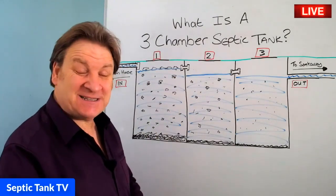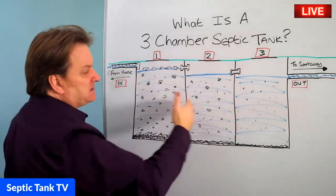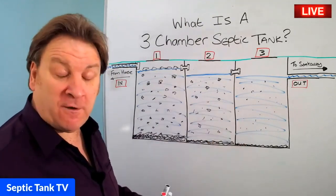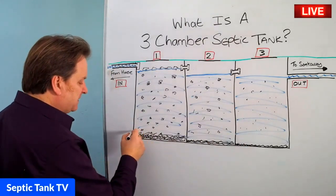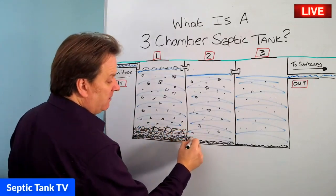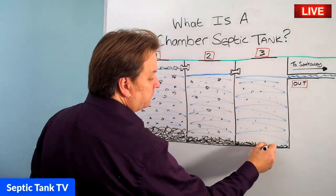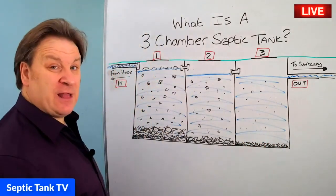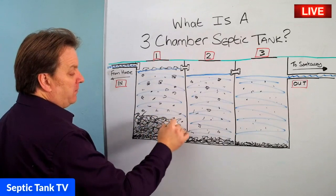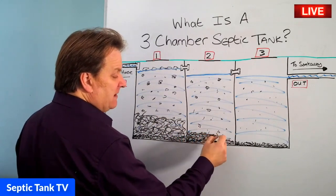The only reason you get your septic tank desludged or emptied once a year is because of the buildup of the debris. So imagine this kind of debris field that you're seeing there, and the settlement that I'm showing you. Let's pretend that's a month's worth of debris that's gone through the tank, right? After 6 months, it will look like that, right? So you can see that it's starting to rise, right? So that's typically what it would look like after 6 months. After 12 months, all the fat and the grease and the sludge and all the debris would probably reach at least 1/4 of the height of the tank.